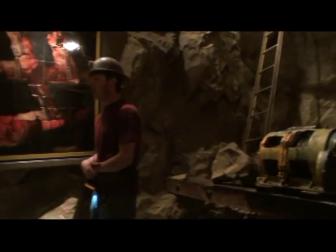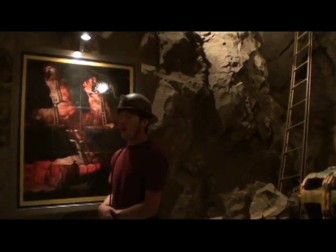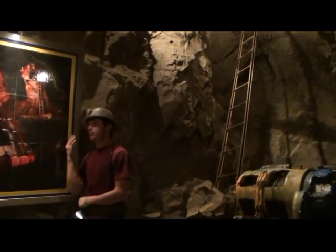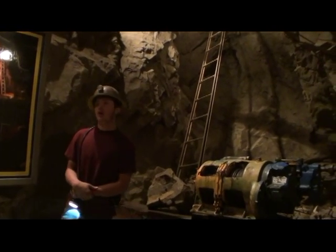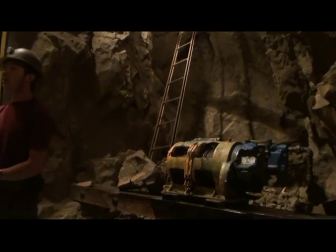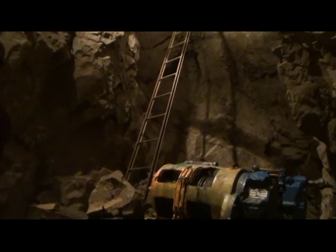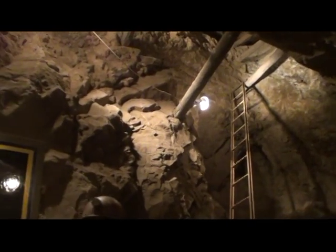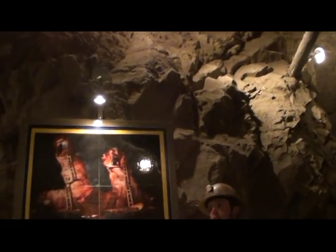So we've been walking through our crosscuts. Now right here's where we hit our first gold vein. And so we didn't drift over too far before doing our process known as stoping, and that's where we go straight up. Now the higher up you go in a stope, the less stable the ribs become. You soon start doing a process known as honeycombing, which is this process here. So we leave these rock patches in between the ribs to create stability inside of the mine.